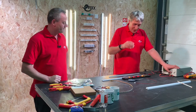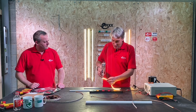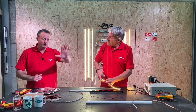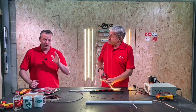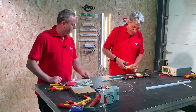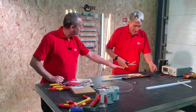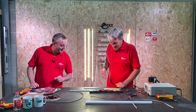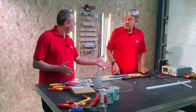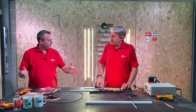I'm going to demonstrate what you shouldn't do — cutting it live. It's only 24 volts. You're cutting it to the length required to fit the profile or dimensions you need. So I need this at 280 millimeters. And now we've got three LEDs that aren't working — and there's a slight burning smell in the room. So that's obviously an issue.